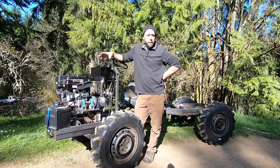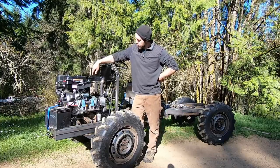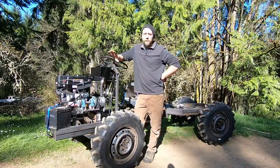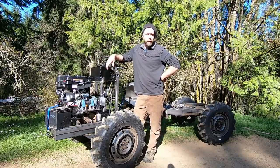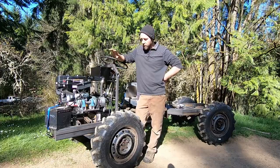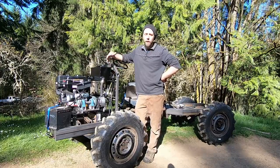So I'm going to order the parts to do a small jack shaft behind the motor right over here, so I can probably order enough stuff to do a 6-to-1 and an 8-to-1 reduction just by playing around with sprockets and things. I'll be able to adjust it, and I'll have all the gearing I need because I want to be able to utilize all 5 gears.